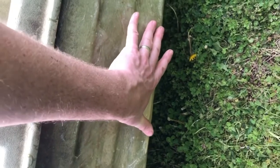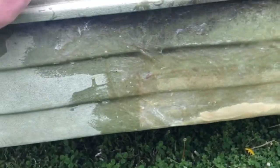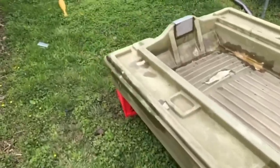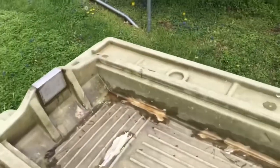This was a really big crack — about seven inches right there. I went ahead and put a piece of cloth that was 14 inches long, so it really went well above and beyond the one-to-two inches of extra coverage. I just really wanted to significantly reinforce this area of the boat. There was another spot where someone probably hit something — I reinforced that too. All of this is cured now. It was about 62 degrees when I started this morning, about 70-something degrees now, and it's all fully hardened. It says it'll take up to 24 hours to fully cure, but I cannot even put a nail imprint into this, so I'm really happy with it.